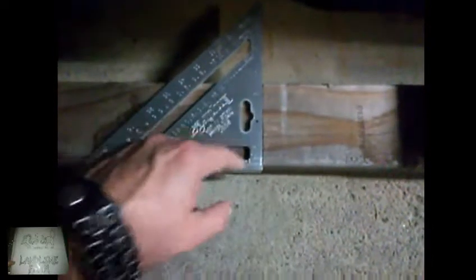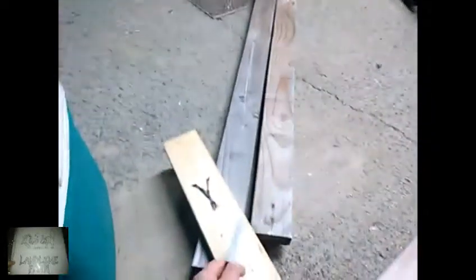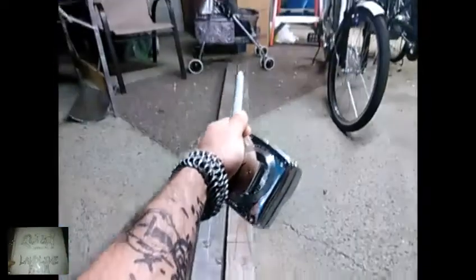First thing you want to notice is that, of course, it's all squared up. So if I was to go like this down here, that end is all squared up at 90 degrees too. Put your template down on the first piece and draw a line right there. Next piece, same thing. Place your triangle and redraw the line just to confirm it's at 90 degrees. Here's all our Y vector vertical 2x4 marked up to 16-inch template cutoff portions. That leaves 80 inches for height.